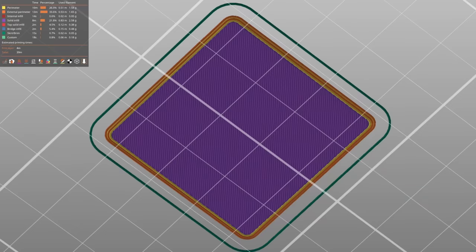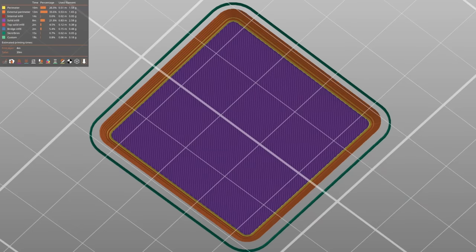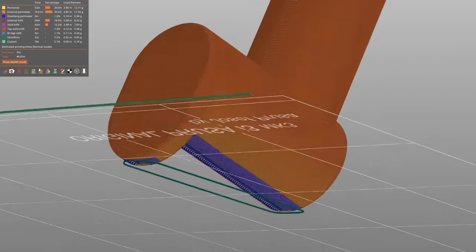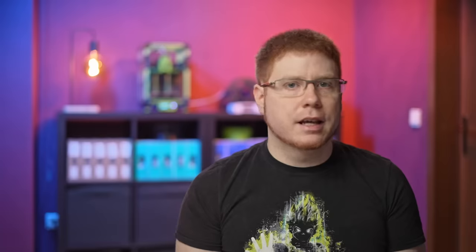Often that's just a matter of replacing rounded corners with 45 degree chamfers. While round corners are aesthetically pleasing in a digital design file, they're not so pleasant anymore after a messed up print attempt. I'll take a flawless chamfer over saggy round corners any day. There are also cases where people simply mimic existing designs optimized for injection molding, like with this cloth rack. From what we can see on the picture, it was probably printed oriented like this and with added support material. Not only does that result in a few print artifacts, it also makes the end result weak because of its layer lines.